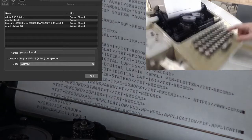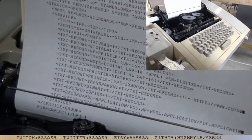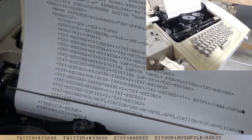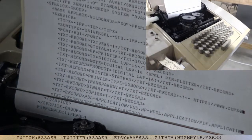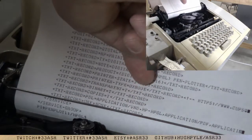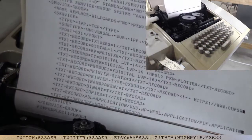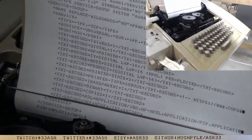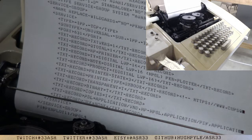That's the Avahi stuff. Now, Avahi just advertises the service. It doesn't do anything else, as far as I know. Again, correct me where I'm wrong, because I'm making wild sweeping generalizations as though I know what I'm talking about, and I only just Googled it yesterday. The printer types in the Avahi spec seem to be really badly documented, but I tried to add up the bits that say this does color and it does letter size paper. So that's Avahi. It advertises the printer. It seems to be actually online. Certainly my Mac thinks it's online.